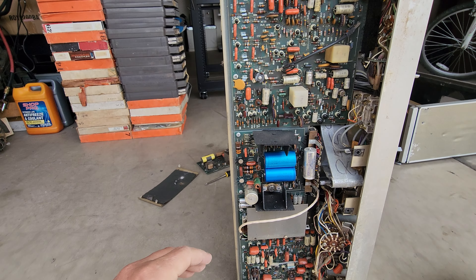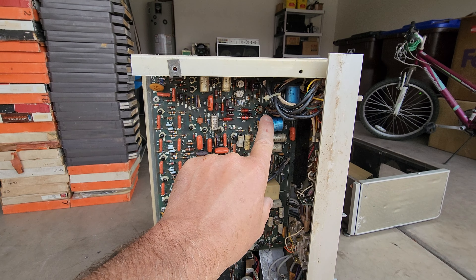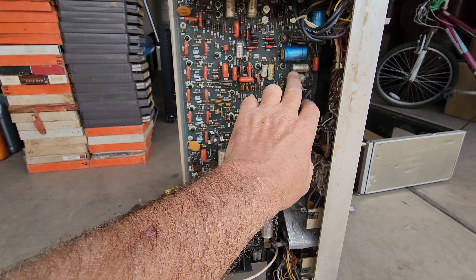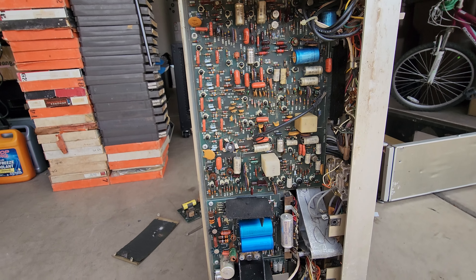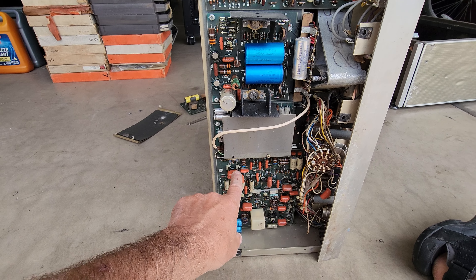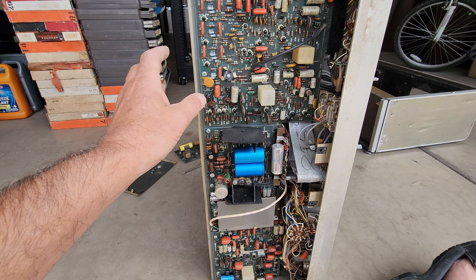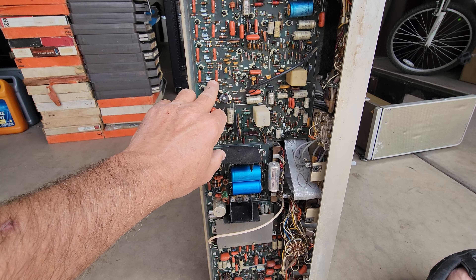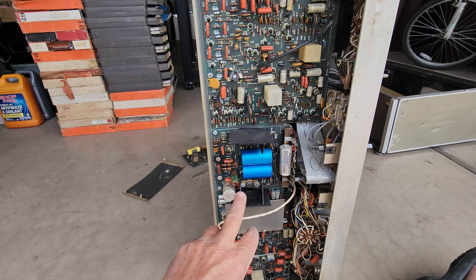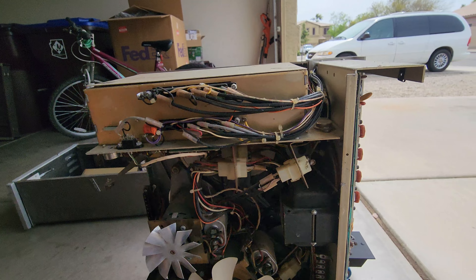As you can see we've got a lot of dried-out capacitors — some are even leaking, right here and here. These can capacitors have to be changed out; they are leaking from very humid climates wherever this thing was stored. You can see they're actually seeping out of the side of the cans, probably because of the shed or wherever this thing was stored. The capacitors should definitely be changed out. I'm shooting the front panel where all the video signal panels are. These orange drop capacitors usually last forever — you really never have a problem with those. It's always the electrolytic cans, and if I salvage this machine I want to change all those out for sure.